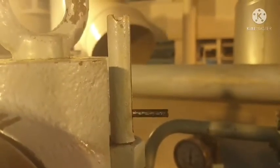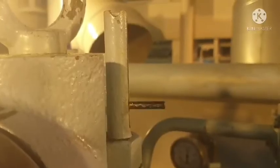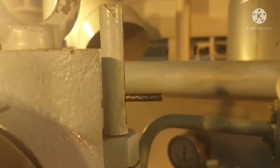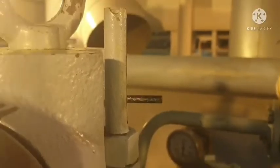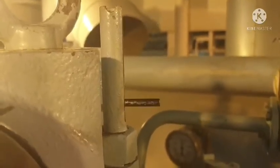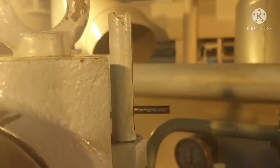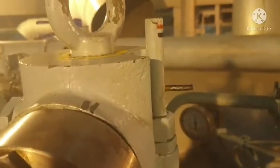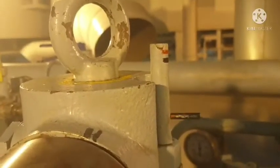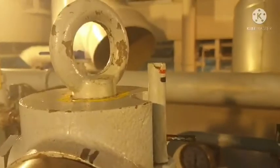As you can see, the rotation indicator rod is moving up and down, moving in sync with the spindle, because that rod is installed just on top of the spring air cylinder piston. The question is: what will you check in relation to the rod movement? Have you noticed any difference in its upward and downward movement? The rod indicator is not staying in a fixed position at its lowest and highest point. I'm going to mark it black and red to clarify — we can now see clearly that the rod indicator is reaching the red mark, which is the highest point, and after some time it only reaches the black mark.